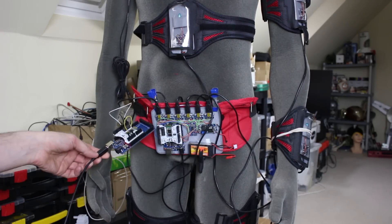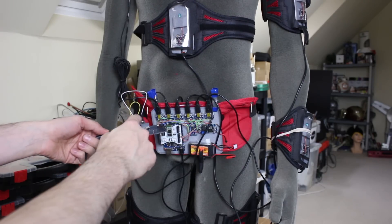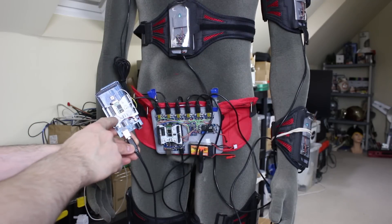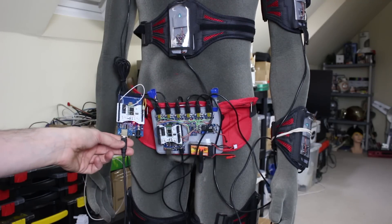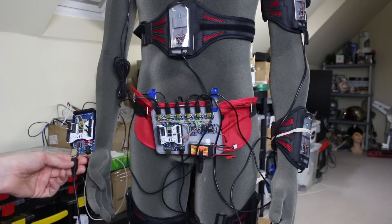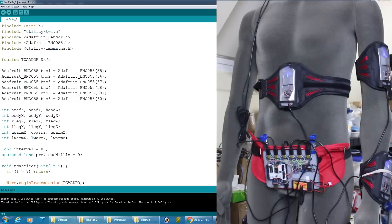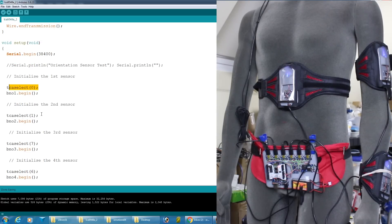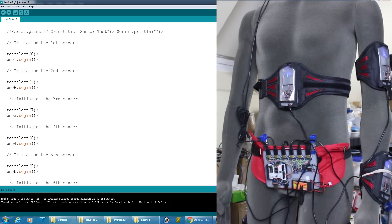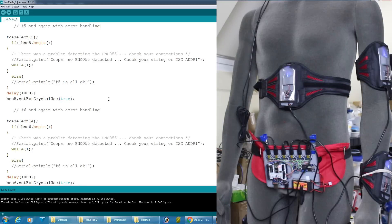I've got the receiving Bluetooth shield plugged into another Arduino just to provide power and get data off the shield. The Arduino has the reset pins bridged out so it's not even booting, and I've cabled the serial line straight into the serial line of the USB-to-serial adapter, so opening a serial port just shoves the data straight to my terminal. I can see what comes out. We're using the Adafruit BNO sensor library, and with the I-squared-C multiplexer we switch between outputs by doing TCA select with a number, then initialize each sensor.